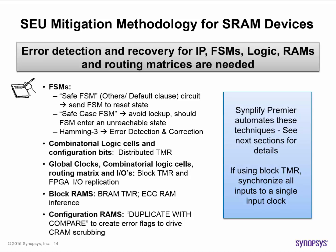We can also select special ECC RAM primitives automatically — that is, have synthesis automatically infer ECC RAMs when generating the design. For configuration RAMs, we can use a technique called duplicate with compare to create the necessary error flags to drive configuration RAM scrubbing.